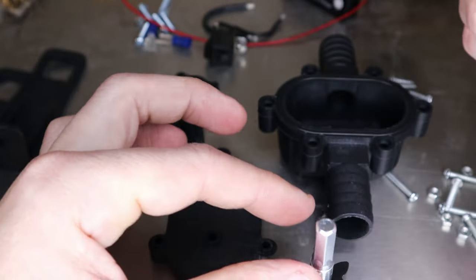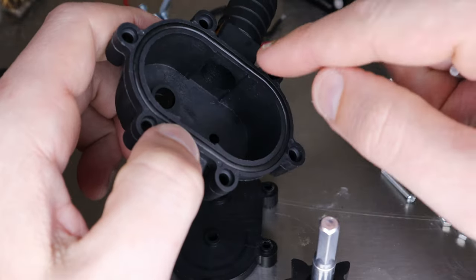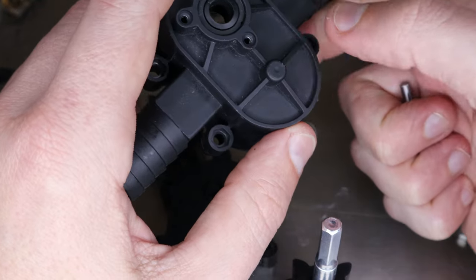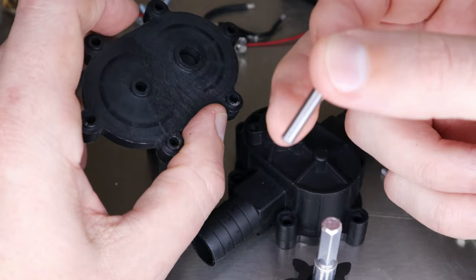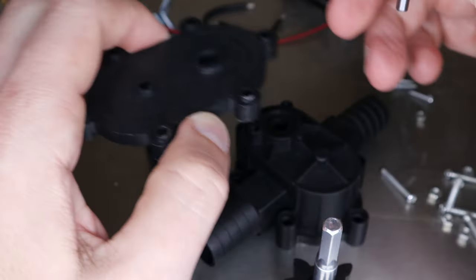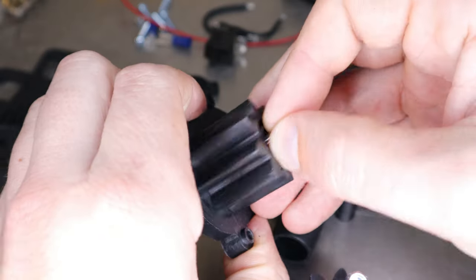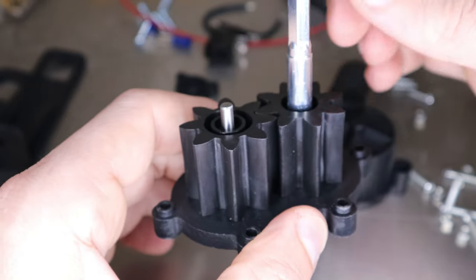I'm going to see if I can build a better mousetrap with this. I like the housing — it's pretty good. I'm going to replace the gasket, find a better way to seal it, maybe use Teflon instead of rubber. I'm also going to get another ground shaft, probably a little bigger because the current one wobbles a lot. If I have to keep these gears, I'll probably press fit the shaft in so it sits in there properly rather than being loose.